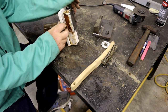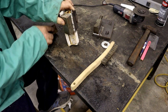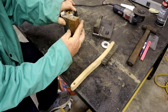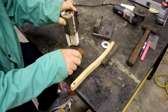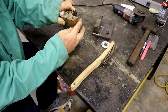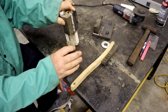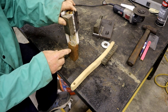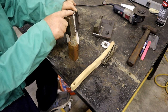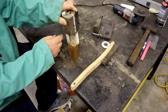So what I think I'm going to do — this will be the new piece — I'm going to take another one like this and weld it in here so that this piece is now on the inside of the gate. I can drill a hole through here and pin it inside with a bolt. It's a two-inch piece of metal, so I'll drill a hole on top and a couple on the sides and plug weld through there. Then when I get to the job, I'll drill a hole in that same position, put a bolt through it, and weld up around here to keep the water out. I think that'll reinforce the joint so it won't come off again.